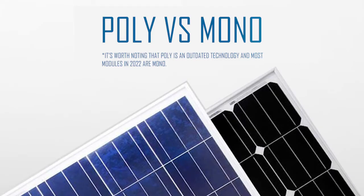Now that we've got some of the fundamentals of how a module works, we can look at how they're applied on site and the different kinds of technology and options you might have for each install. One of the key considerations on each install is whether you go for a mono or polycrystalline panel. Modules that use monocrystalline silicon are typically slightly more efficient and characteristically have a black look to them, as opposed to the bluish hue of a polycrystalline module.